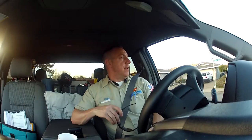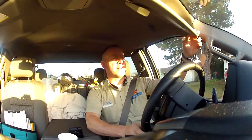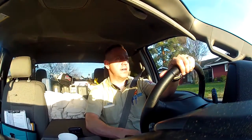That was a pretty easy call with the duct job. She said she wasn't having any airflow to her daughter's bedroom. We went in there and located the register — it was covered up by a bookshelf and the register was closed. I turned on the fan on the thermostat, and once we moved the bookshelf and opened up the register, it was flowing. It had plenty of airflow. They're going to give that a shot — I'm pretty sure there's nothing wrong with the duct under the house.